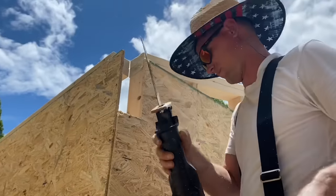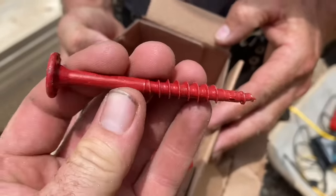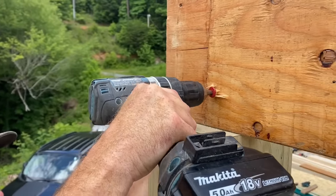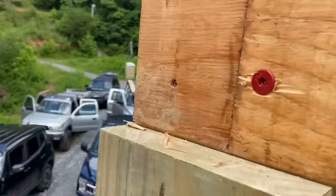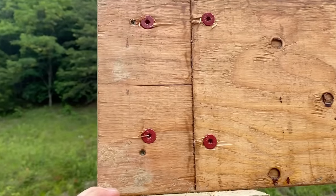After our posts were set, we simply made notches in the wall to carry the load of the other end of the beam — an easy way to do it. Then we attach the beam to the post with these structural screws. Give me an impact. That was one way to do it. That will definitely do it.